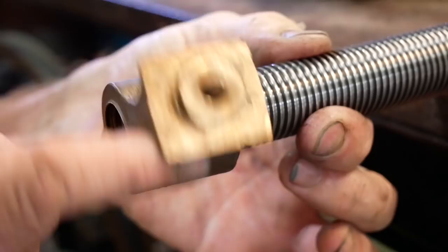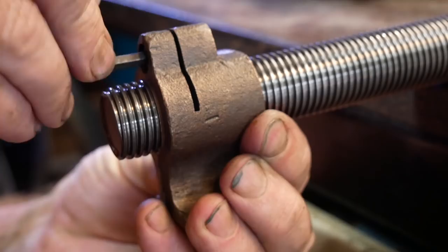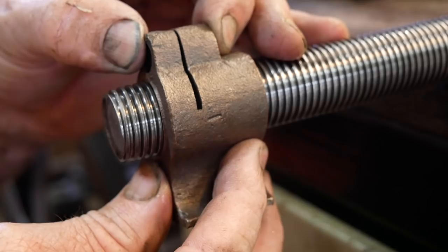That's one of the lead screws and nuts off for one of the axes, and you can see there's a bit of backlash there. So I guess that's an adjustment that I'm taking up to see if I can remove some of that backlash. And of course, the middle of that lead screw was probably where most of the wear is, and it still does have a bit of backlash in it. So I might have to replace those nuts.